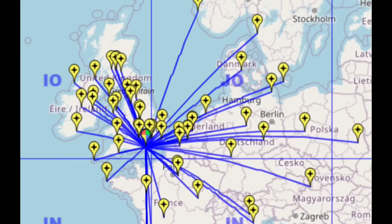We didn't actually use 80 metres today as I packed down before nightfall, but during the IOTA contest 80 metres did really, really well — I made over 60 contacts around Europe and the UK. It's basically a cloud warmer on 80 and similarly on 40 metres. On the higher bands we see useful gain on 10, 12, 15, and to a degree 17 metres off the ends of the antenna, while 20 metres is more broadside. Overall, if you're going to use one antenna to do as much as possible on field day, the 133-foot end-fed half-wave ticks a lot of boxes. Don't forget to click subscribe. 73, we'll catch you again.